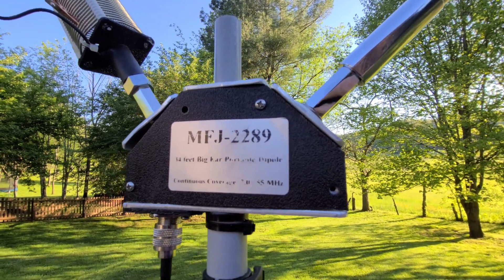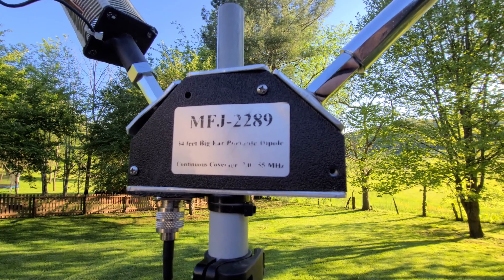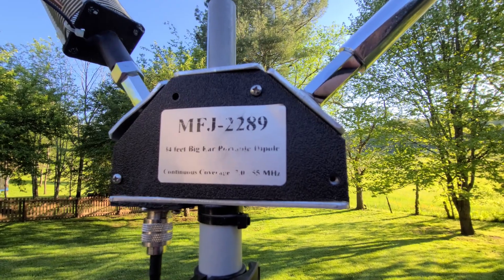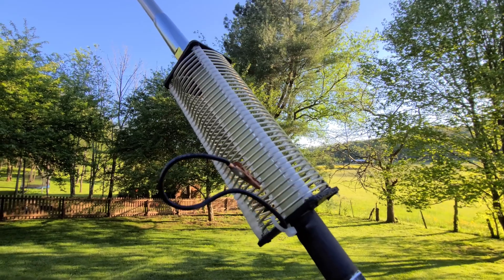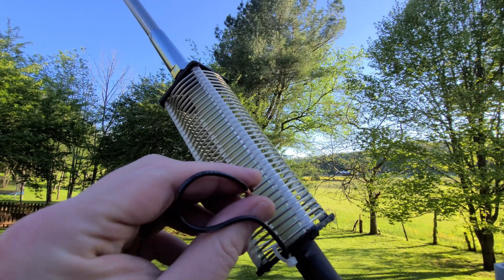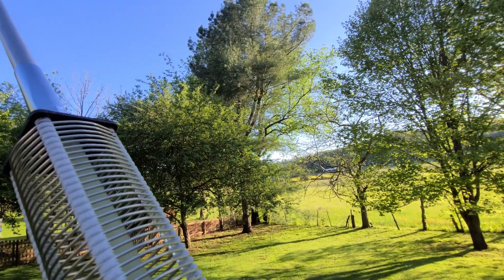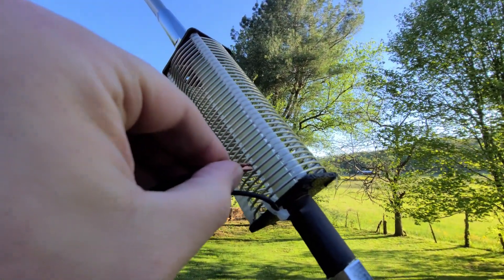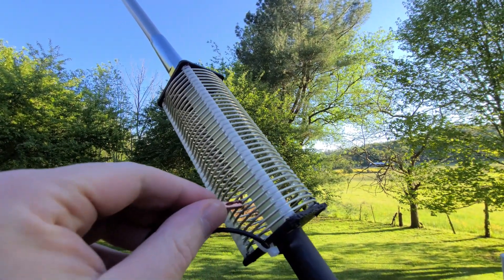Go look at the first video — I'll put the card up in the top right. We've got a lot of new subscribers who may not have seen this antenna yet. Let's take a look at the coil. In this particular case the coil is installed, and what you do is use this clip right here to adjust. Right now I've got it up about six coils, which is where I need it to be on 40 meters.